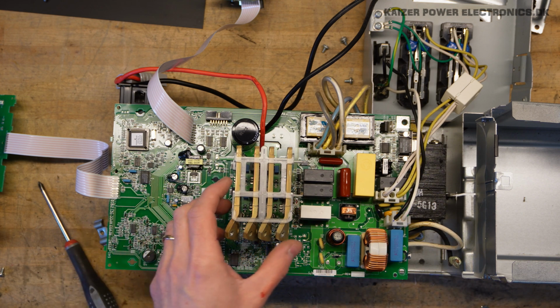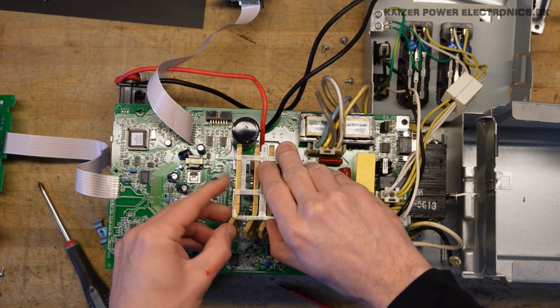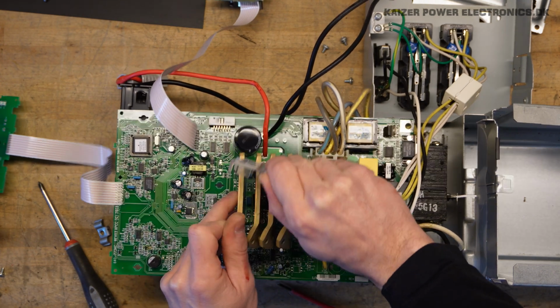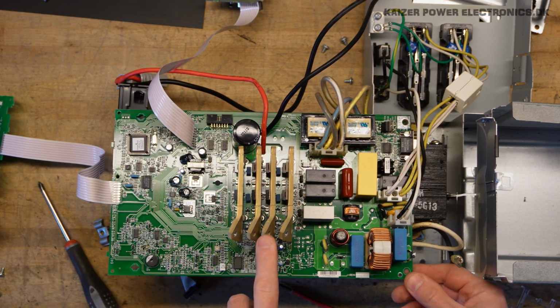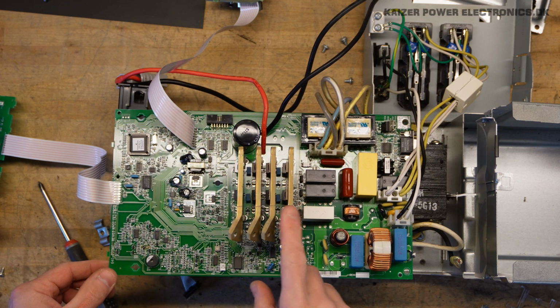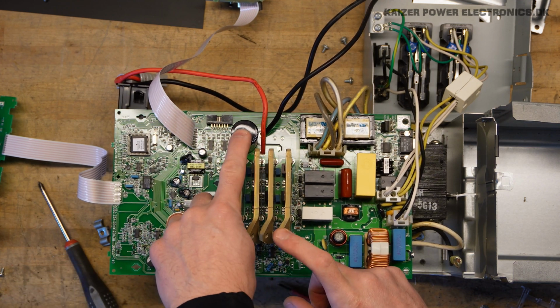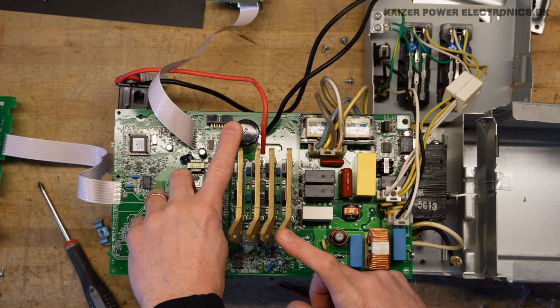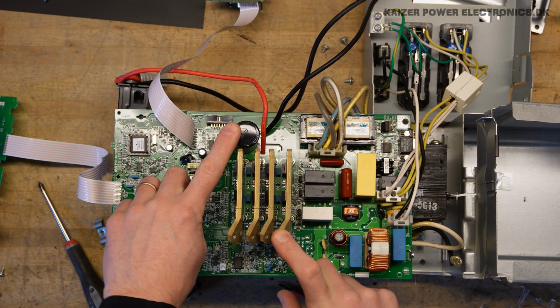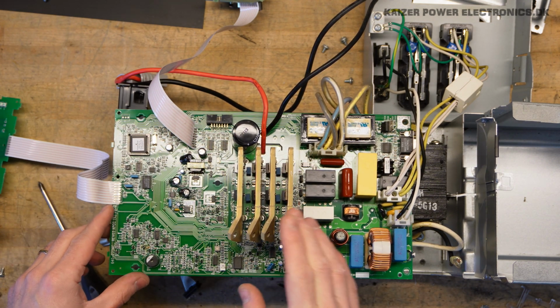The plastic cover over the heatsinks here is a pretty dead giveaway that these heatsinks are actually live. So these are energized with the plus and minus of the bridge. And judging by the capacitor here, which is 2700 microfarad at 40 volt, that is a low voltage from the 24 volt DC battery pack.